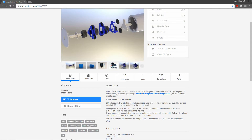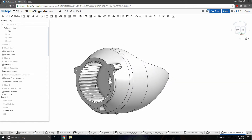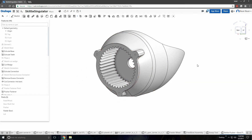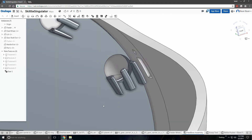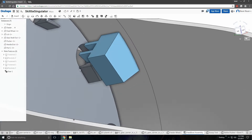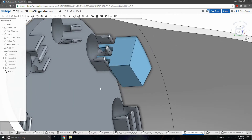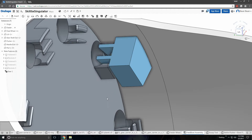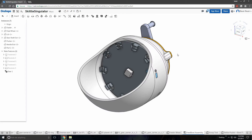Sorry your parents gave you such an odd name. Our gearbox specialist tweaked the original design by taking it down from three stages to two, giving us a gearbox ratio of 11 to 1. That way the feed wheel isn't spinning like a runaway teacup ride at a county fair. The final piece of the feed bowl is the pusher — a wedge that fits between the teeth of the feed wheel to convince the Skittles to enter the hole. It is designed to push the Skittles completely through so as to avoid any unfortunate Skittle crushing or cutting. With all these parts to print, it'll take a good week to finish them all. Time to get to work, fellas!